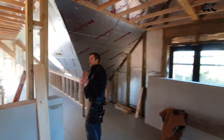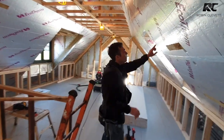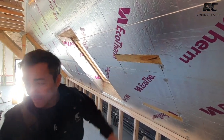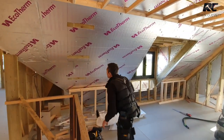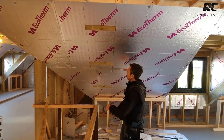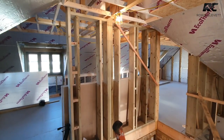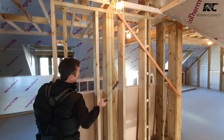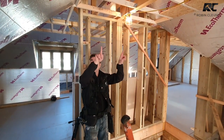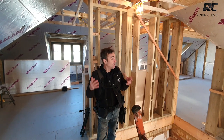Where we're having a wall to create this bedroom and the stairwell, there's going to be a door coming in here. We get some 75 by 25 grounds — the last skin is 25mm — and we knife them in, remove the insulation, fix them into the rafters. We'll tape these up with silver foil tape and plasterboard all the way over. We've leveled three datums here so that once the plasterboard is up we still know where they are. We'll whack the laser around and when we put our wall plates in for the stud work we know exactly where to fix them.